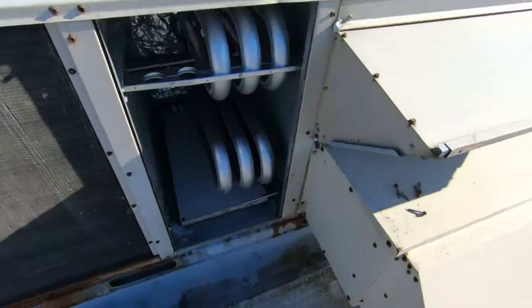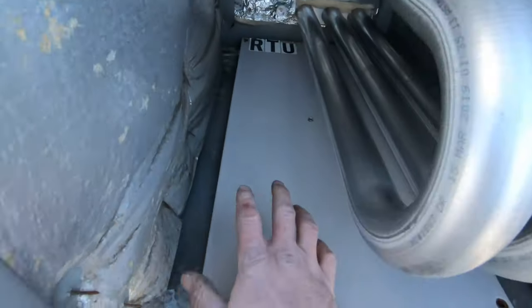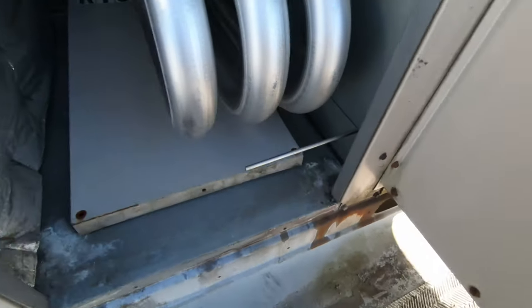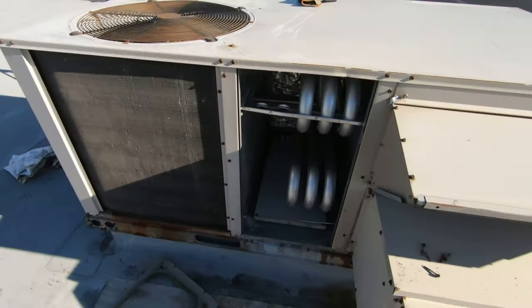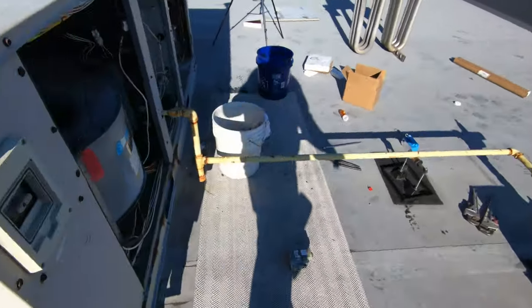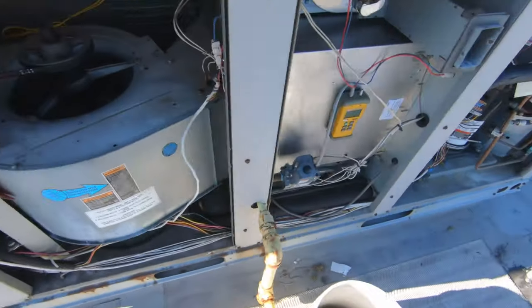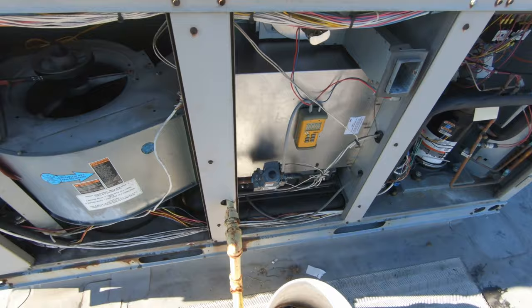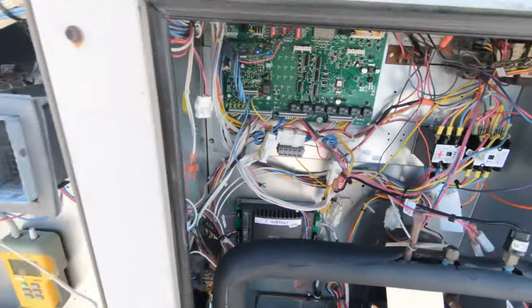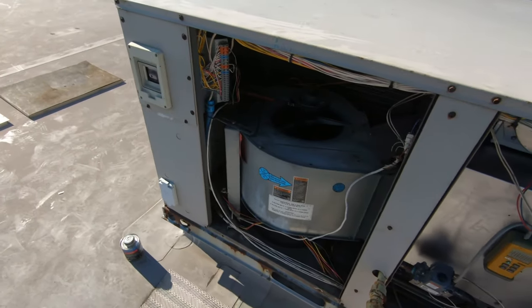We're all blocked off on the supply — I just used the access panel from this area, it fit right over the top. Perfect. Got the lid on, all the screws, everything's wired back up. Got my manometer hooked up. I've got to get this blower door in place, and then I think we're going to be good to force it into heat on the control board.